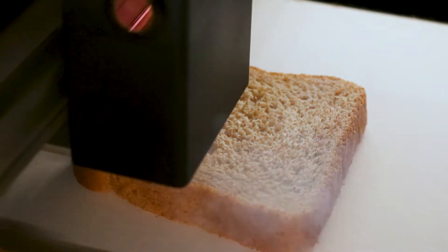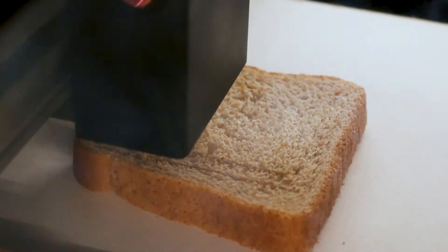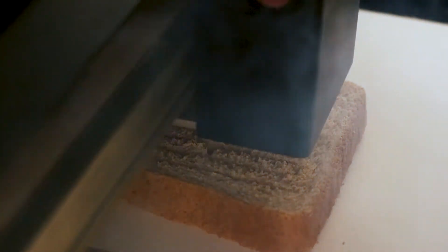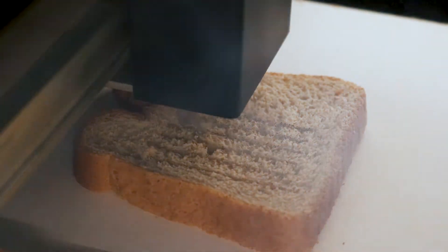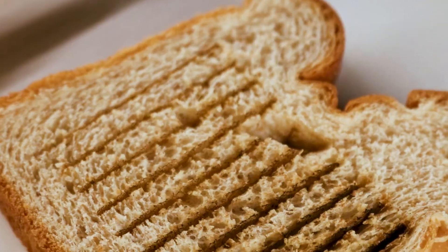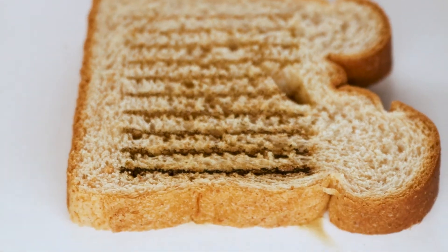While watching the laser cutting through the surface layer of the bread, I noticed that the depth of the laser is based on the density of the fibers. If there's more fiber, it takes more power for the laser to cut through. Since bread has an organic pattern of fibers, the best way to cut all the way through is to use a power and speed that will make it through the most dense part of the bread. When the test was complete, I lifted the bread off and looked at the results — the first few settings looked great for scoring and engraving, while the last two worked for cutting.